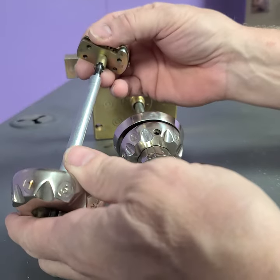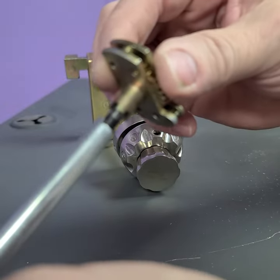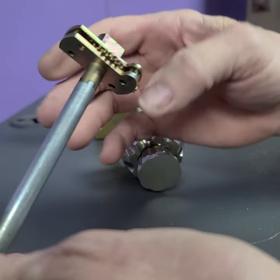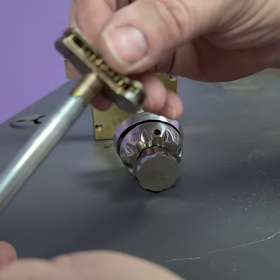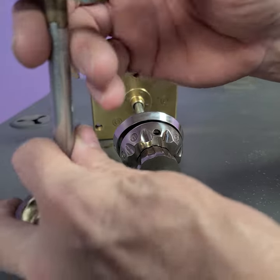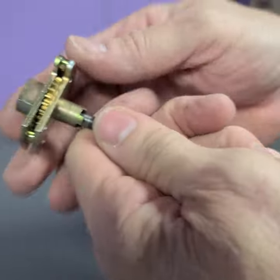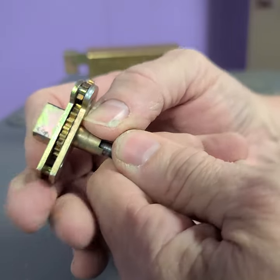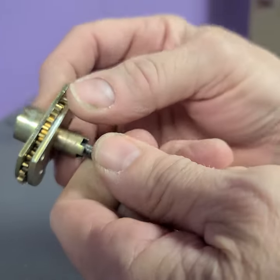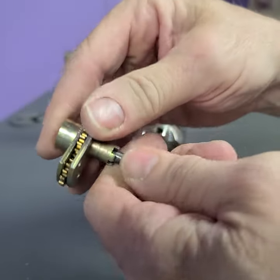So you have your outer dial, which has this shaft that's hollow. And then it will go against this, what I call a distributor, and it locks in place against it, but it can move out some by that spring. So the inner shaft turns this gear, which in turn turns this smaller gear. So when you're turning the clicks, this little gear right here on the end, you're turning a click each time.